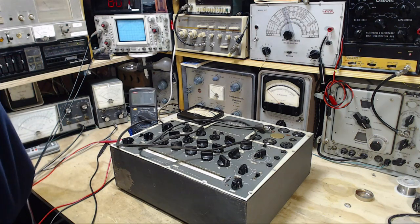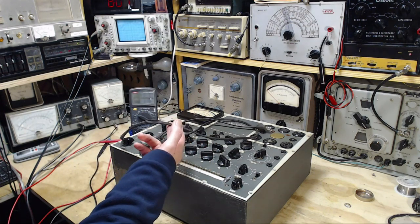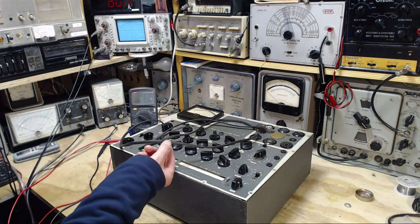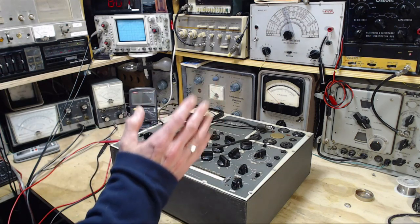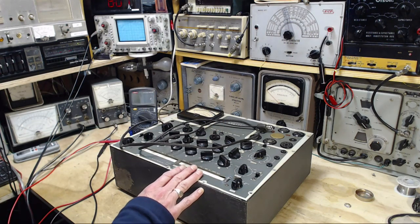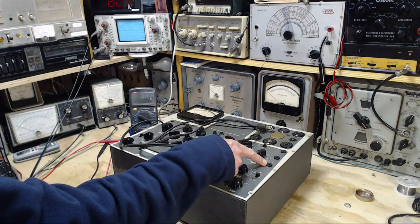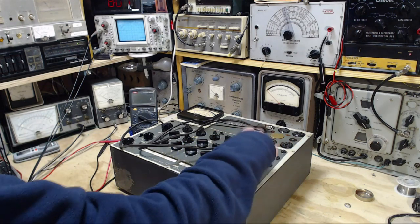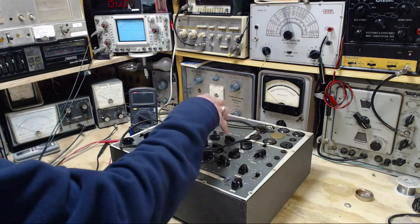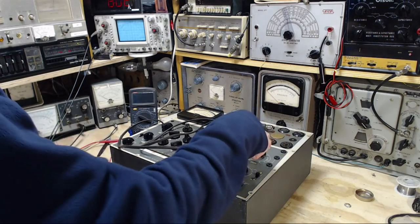So let's start by taking a look at the schematic for this. What I'm curious about is, how is the power cord side of things taken care of? Is there maybe a capacitor that runs from one of these lines to the chassis, something like that? And are there any other connections that are made to the chassis? And I remember there are. I remember distinctly this ground connection here is connected to the plate deck top, whatever.